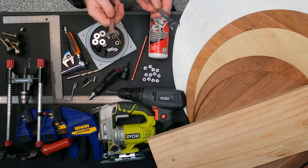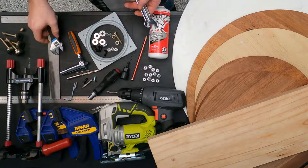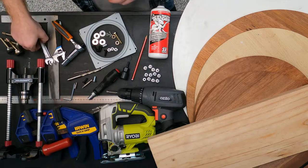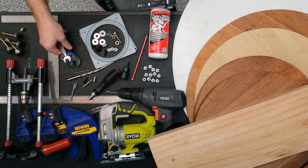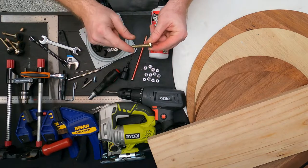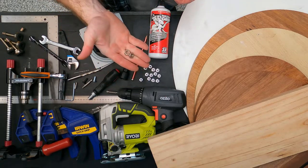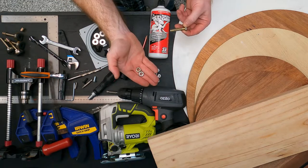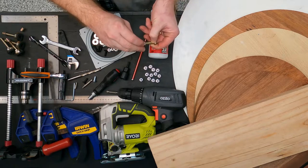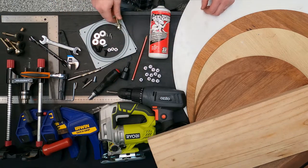So we got that. You will need two of the same size spanners or a shifter, whichever, and also a ratchet. I mean, you don't necessarily need the ratchet if you've got these three, but the reason why you need those is because you actually need a bolt that's at least 2.5 size bigger than the insert thread. And then you also need two nuts. You need two nuts because you're actually gonna thread them both on to this, okay? But when I get to when we're using that, it'll make a lot more sense.